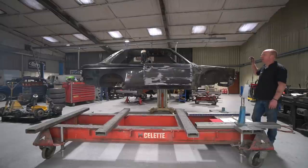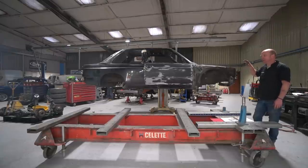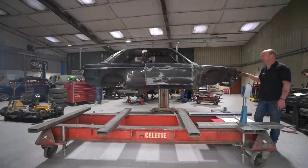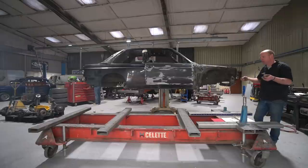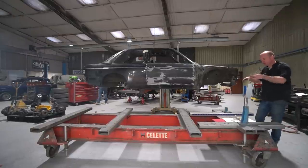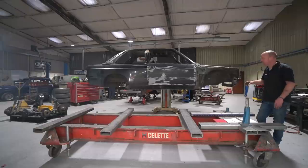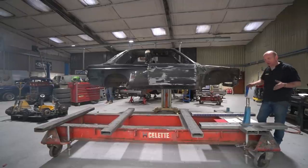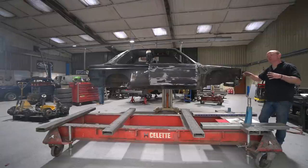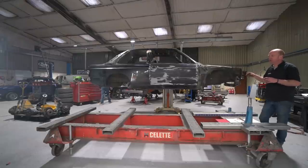When we're doing alignment-critical operations on a car body shell or chassis, or building a chassis from scratch, it's very important to keep all the datum — all the position-critical parts of that car — located accurately. If you're building a chassis from scratch with suspension pickups in certain positions and you're just working in free space, it's very hard to ensure those pickups end up where you want them. Having some sort of framework to build on is quite important. You could build a specific frame to locate all those parts relative to a level flat floor each time, but that becomes quite time inefficient and very expensive.